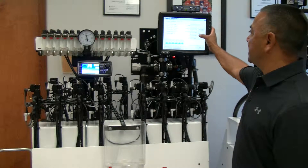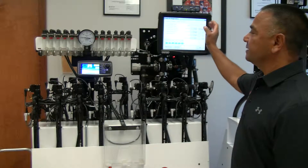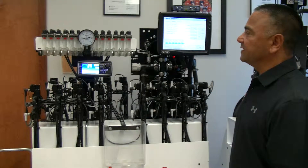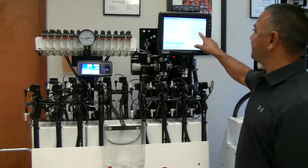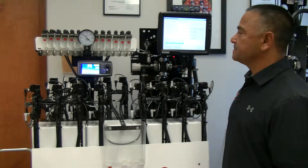I'll slow this down — going from ten miles an hour to nine, eight, seven, six, five, keeping my rate at five gallons an acre. If I drop my rate down to four and it falls below 7 PSI, it'll shift — you'll see that shift. Now it's on the high side. If it goes below 7 once again, it'll shift back to the low side.